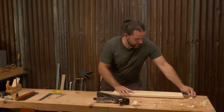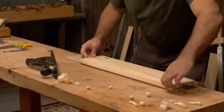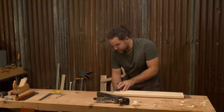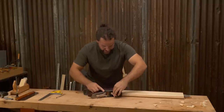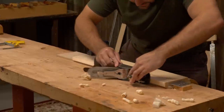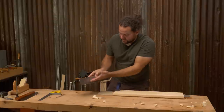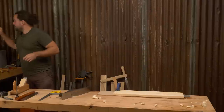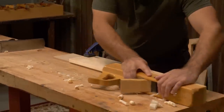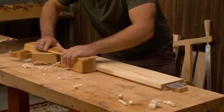And if I had long lengths to do, set it in so it always wants to be in the spike because that way it can't move laterally on you. Get a pump clamp, pinch it down — and this could be right over here — and now we can actually use both hands. We can really focus on keeping that plane pressed down and where you're positioning those shavings. Your only limitation on thickness really is the depth you've got. Something probably better would be a big heavy wooden plane. This works even better. I love wooden planes — you can just hold them. These metal ones are dictating to you. This thing isn't. Just whizz through it.